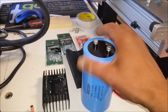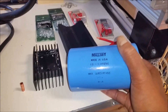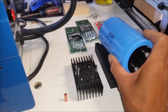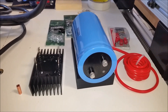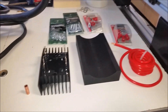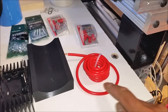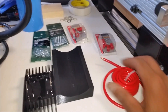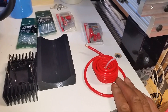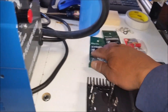You're going to need a capacitor — this thing's pretty big. This one is a 30,000 microfarad, 50 volt. This is a mount for that capacitor. I 3D printed that mount — it's not a necessary thing, but I was able to do it. You'll also need 8 gauge stranded wire. A good place to find it without ordering is an auto parts store in the battery section. You'll also need some ring terminals and miscellaneous screws.